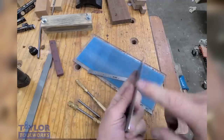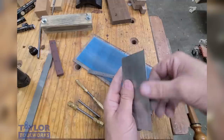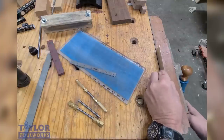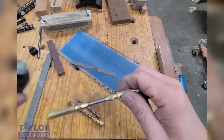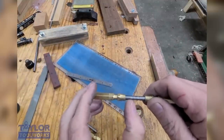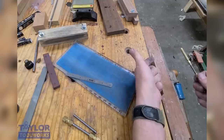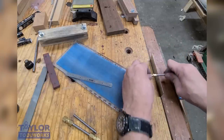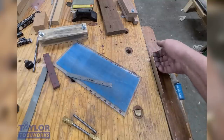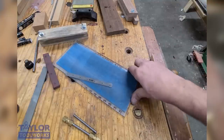Now I've created a smooth, straight edge on the face and smooth sides at 90 degrees — you can actually feel that it's sharp. Now I drop this in my vise, take my AcuBur, put a drop of oil on it, and run the narrow five-degree groove over the scraper for two passes. This creates a burr on both sides of the scraper simultaneously. Then I move to the middle ten-degree groove and do one pass. I'm putting about five to seven pounds of pressure. I feel the edge with my fingernail and I can feel a slight burr — so now I know I'm done.